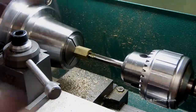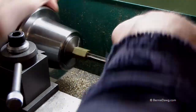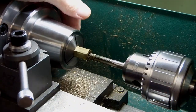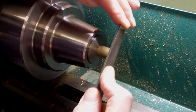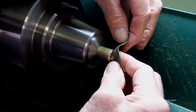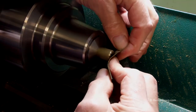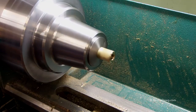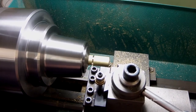I'm tapping the thread for the Nova end of the adapter — it's an M8 by 0.75, which requires a specialty tap. Below in the description I'll have a link to where I get those specialty taps. I use a file to create a little chamfer at the end of the adapter so it looks a little better, and clean all that up with some abrasive paper. I also clean up the inside with a small chamfer to ease the thread as it goes onto the stove. Then it's time to cut off the piece of stock and flip it around in the chuck to start on the other end.